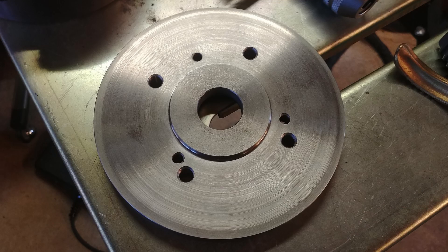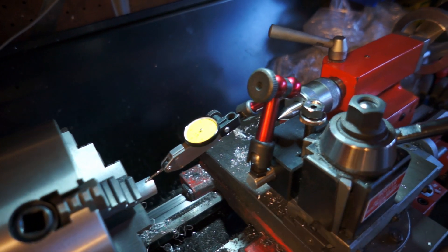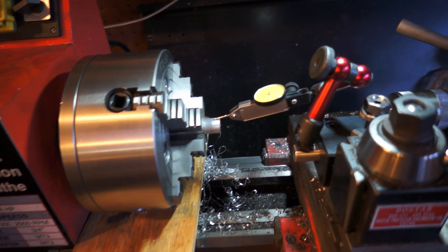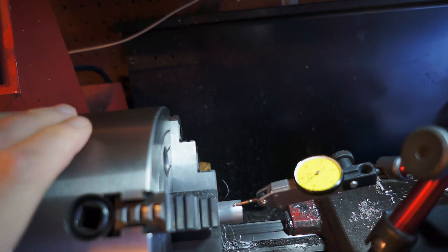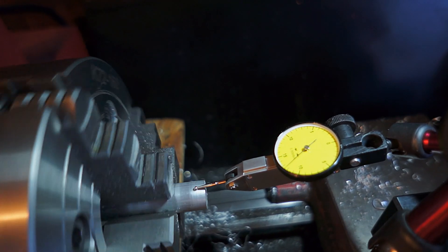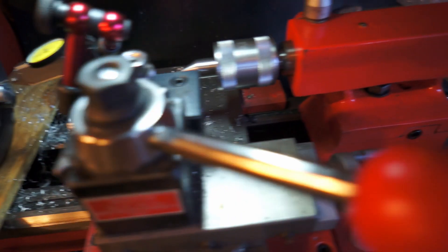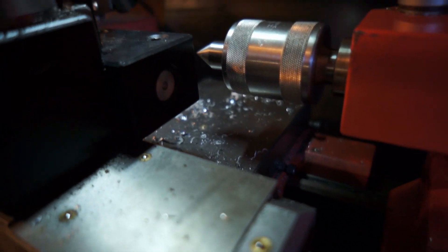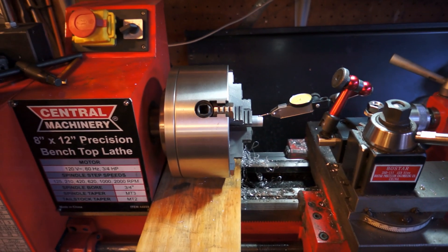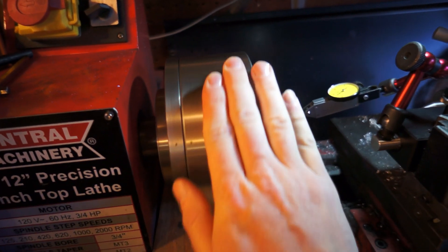The other thing I needed to do was I had this indicator stand, but nothing to mount it on. So I mounted it on a boring bar holder, which I never used because it's a small lathe and I can't really fit a 16mm boring bar. That seemed to be the perfect solution, and it does indeed work out rather nicely. It's a little out of true here, but that is the end of the piece of stock that I made this out of — it goes all the way through the boring bar holder. We need this to be able to turn the shaft with absolute precision. That's why that was done.